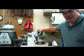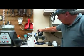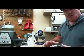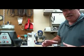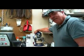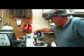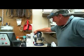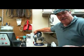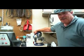We're going to then go to the vacuum table, which will pull all the bubbles out and help that investment stick to the wax. All that detail that we drew in that wax and designed on the computer, we want it to turn out in your mounting also. So the purpose of the vacuum would just be to get the bubbles out? Yeah, because this mixing right here is getting a lot of bubbles into it, and it also helps it stick to the wax. Any cavities or places where maybe there's an air bubble inside, it'll pull that out, and you're not going to get little bubbles on your mounting.